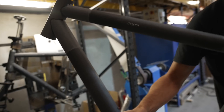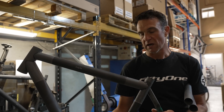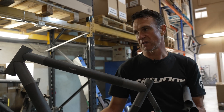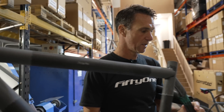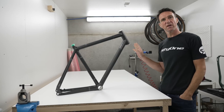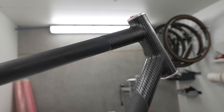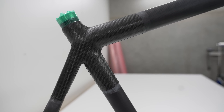That's really the first part — it's kind of a three-step process. The next step is we'll actually build up a larger fillet on all these joints, just to give us more surface area and greater strength, and then most importantly all of these joints are then wrapped in carbon fibre. Here's a frame that's been actually wrapped — you can see all this pre-preg carbon here, which is a kind of third part of that step.